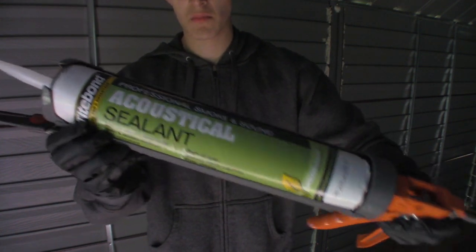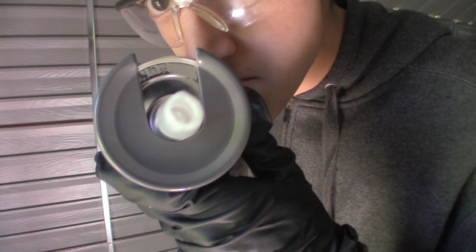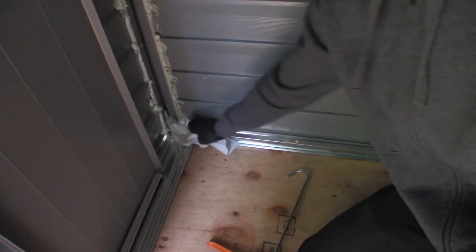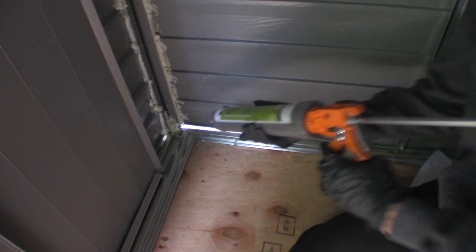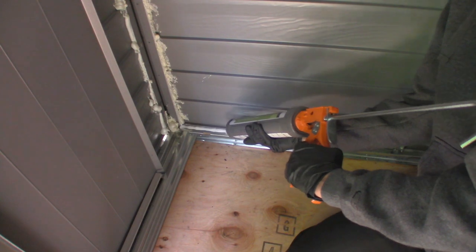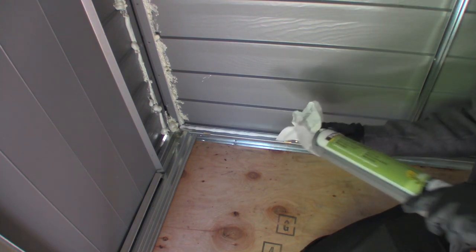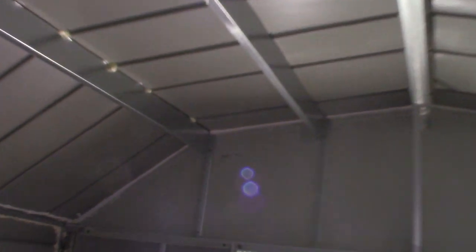The big gap filler worked very well, but won't be necessary for the smaller spaces. These smaller spaces required something that doesn't expand so much. So we got acoustical sealant — three of them to be exact — but we also had to buy the caulking gun to use it. Cut the tip, poke a hole through the inner cover with something thin, and as always, keep it safe. Just like with the rubber tape, wipe off the surface before using the sealant. Have something you can use to cover the end of the sealant when you stop using it. We used the sealant along the floors and various edges of the ceiling, and also used some on the outside of the shed just for extra measure. Basically, anywhere where there was a crack line, it was filled up with the sealant. People typically apply it along all the edges of a room.